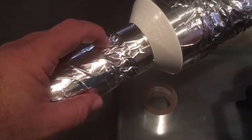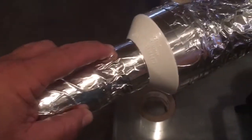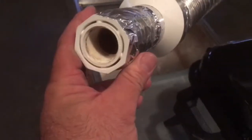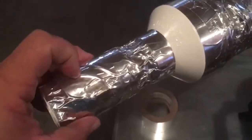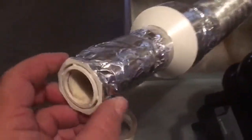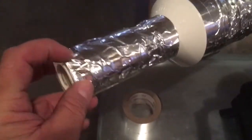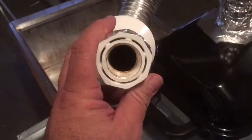At the one-and-a-half-inch end I used a short piece of one-and-a-half-inch PVC pipe and taped it fast, because I wanted to put a bushing onto the PVC pipe. There's a standard one-and-a-half-inch PVC coupling — I put the coupling on the pipe and taped that. Then I use this bushing whose outside edge is the same as the outside diameter of the PVC pipe, so that outside goes into the coupler and is taped.